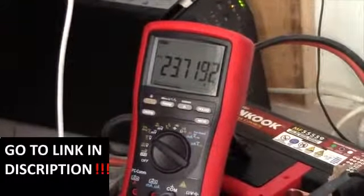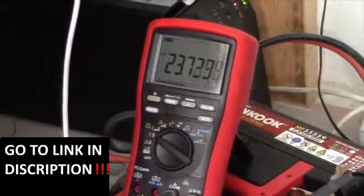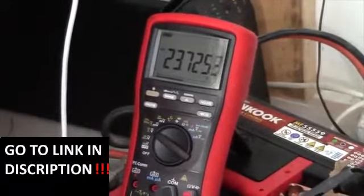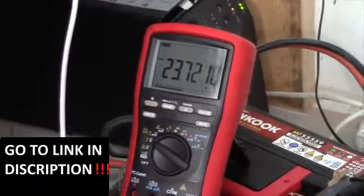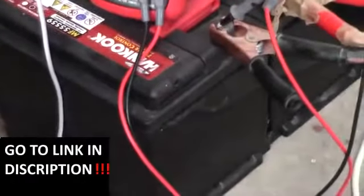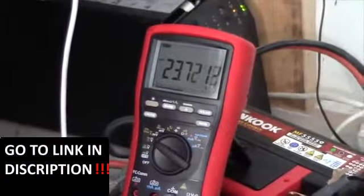I just gave these batteries a big shake, shaking them all over the shop to mix the electrolyte up. Our loaded voltage with just my computer and some equipment went up by about 0.4V from just doing that. So it seems the electrolyte had gotten a bit uneven inside them - that's a good sign. Now I've just got to cycle them.